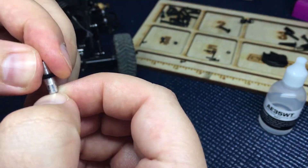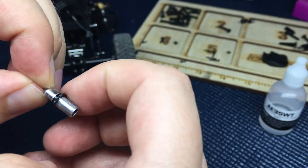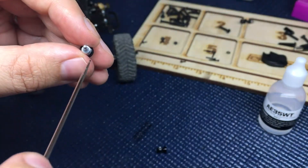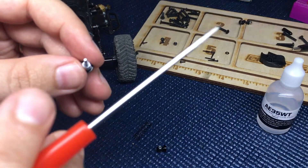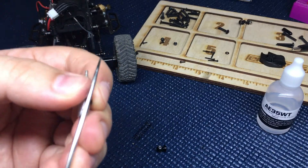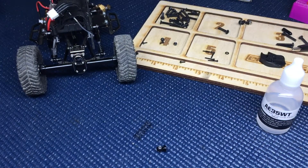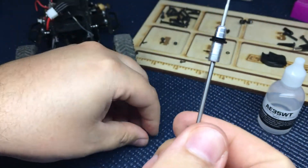There's some friction, much more than there was before, but it's still rather free. In some cases you'll notice it's going to be a little hard or jumpy. In that case, just remove the screw leaving the white bushing and o-ring inside, and use a sharp tool to kind of push around the gap in the hole, making sure everything is seated well — sometimes when it's not seated well you'll get that effect.